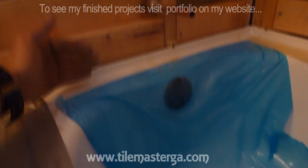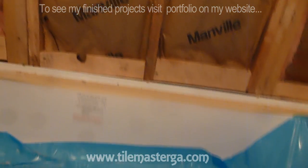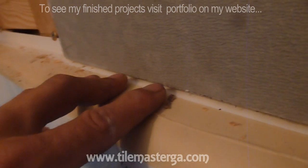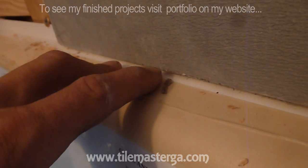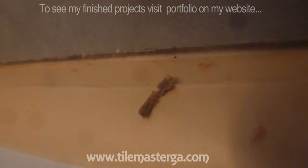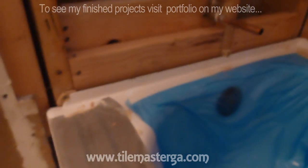I'm also never running board all the way to the tub. You can see some contractors run board on top of the lip, pretty much setting the board on the top edge of the tub. It's not recommended because over time, grout eventually will have small cracks, and water will be getting in there a little bit. This water will get in direct contact with the board, and no matter what type of board we use, it will absorb this moisture, potentially causing mold to grow or discoloration of the grout and the tiles. So I'm not recommending to run board all the way to the top. I'm always leaving a gap, and this is how it's going to be, something like this, once I have the board in place. I'm going to do this on each side.